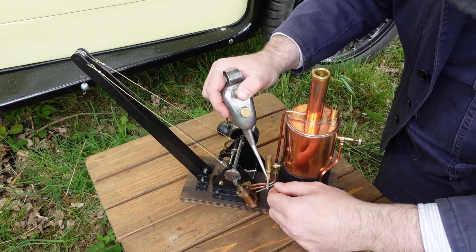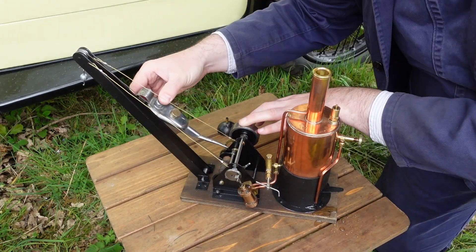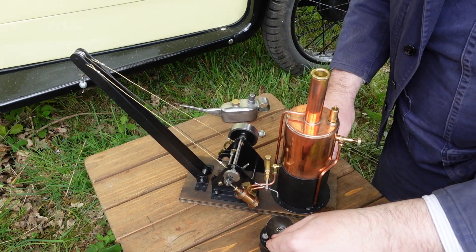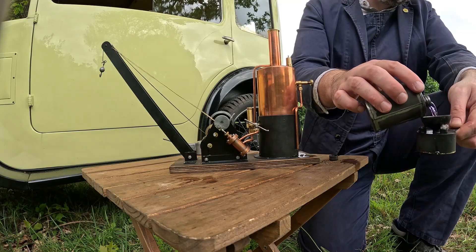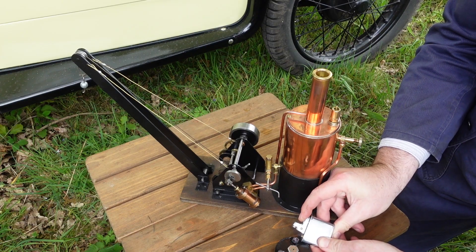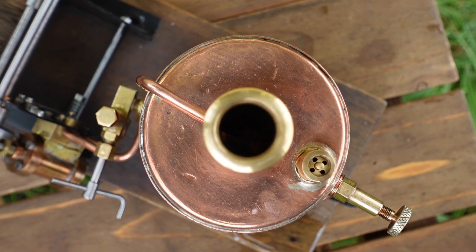The best thing to use is a special steam-grade oil, which is slightly thicker than normal engine oil. We'll just screw the top back on there. Then, very importantly, go around and lubricate all the moving parts of the mechanism — for this I use the same engine oil that I use in Primrose. Just go around with the oil can — a very important job to make sure everything's nice and loose and free-rolling. The next thing to do is to fill our methylated spirit burner, so we'll put the funnel in there and fill it up.